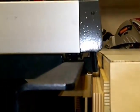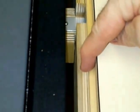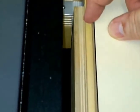I can remove my rip fence real easy, still have it usable, but at the same time have a nice outfeed table without too much of a gap. From here to here it's about an inch and a quarter to an inch and a half, and then of course still about two inches to an inch and three-quarters for the actual angle iron. So a little over a two-inch gap right here, but I have yet to have any problem with any wood trapping in there. With that space, sawdust can still fall down through, so it's not creating a trapped location.